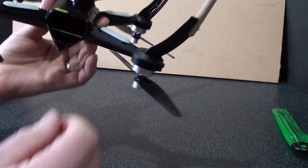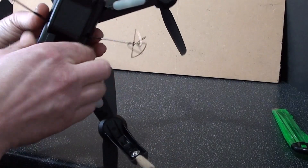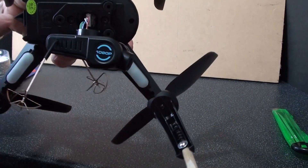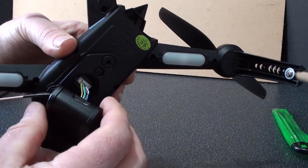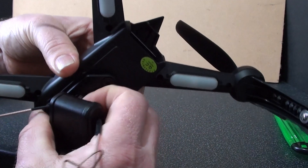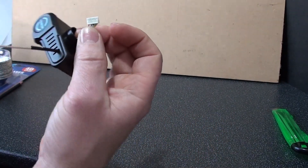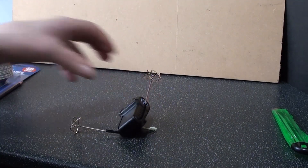It's probably better to take the camera off — less fiddly. Turn clockwise then anti-clockwise, and then towards the back of the drone the multi-plug has a little flap — get your fingernail behind there and the camera pops off.